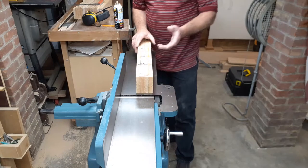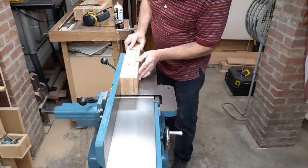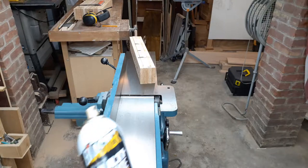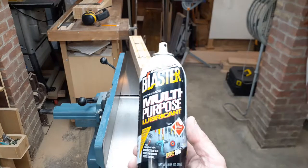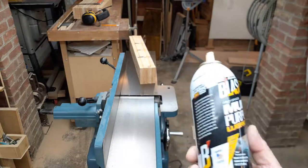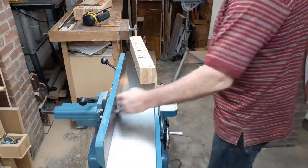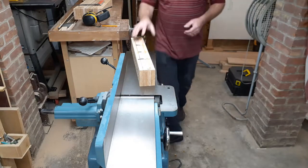Can you imagine — you probably can, especially the older guys — hand planing this, right? But this is taking care of that for me. I'm telling you, this is like butter right now. I'm elated. I'm not sponsored by this product or this company, but this here is very good — Blaster Pro Grade multi-purpose lubricant with Teflon, since 1957. This is just a no-brainer. Put that on your bed. This is really, really smooth right now. The first couple of passes — more like the first 25 passes — it dawned on me that I should lubricate it again.